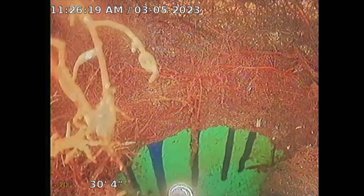There's a little dip, and there are some tree roots — that's why it's causing a little issue. I didn't expect this from this property because I didn't see any trees in the front, but you do have a tree root intrusion here. That's not a good thing. I'm going to have to mark it. I have a locator that will help me figure out where this area is and tell me how deep it is. As soon as I saw that water backing up like a little puddle, I knew it was going to be an issue. You normally see water just flow with no obstruction.